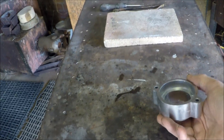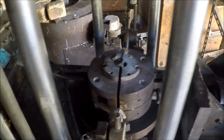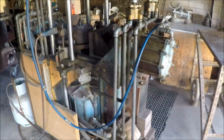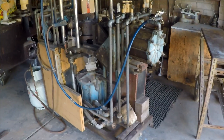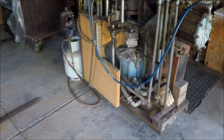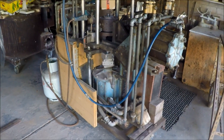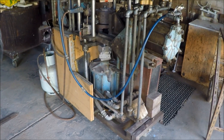It's made in the gravity die, or what you Americans would call a permanent mould. This is the machine that holds the die that makes the part. The die is sitting here in the middle of the machine with two torches sitting on it that will be used to preheat the die. The machine was in its former life used by a well-known brake manufacturer in Melbourne to make master cylinders, slave cylinders, that sort of stuff. The large cylinders on the machine — that bottom one is 10 inch and the one at the end is 8 inch — were necessary because the machine was run, rather foolishly I believe, on compressed air.